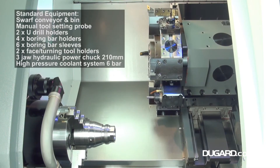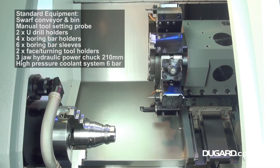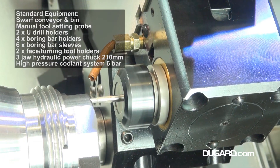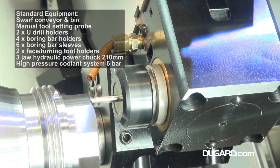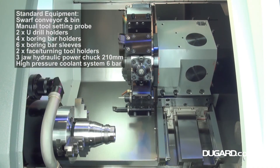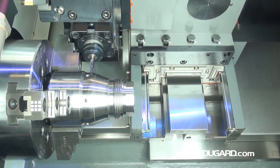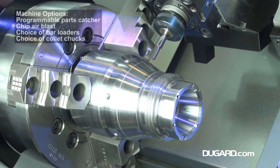The tool shank is 25x25mm and the maximum boring bar size is 40mm in diameter. There's a manually positioned tailstock as well as a programmable quill with 4 Morse taper. The programmable quill travel is 80mm and the quill diameter is 75mm. The PL240LM is a compact turning centre weighing in at just 4,000kg.